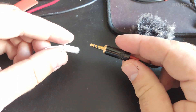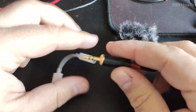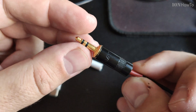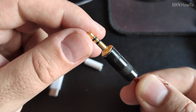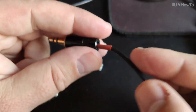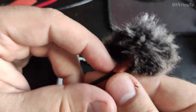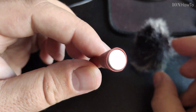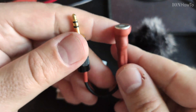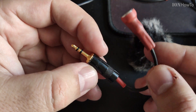It works pretty well for my phone, but it can also be used on a regular recorder. This one cannot go directly into the Apple adapter or any other adapter, because it's TRS. For mobiles you basically need four things on the jack, and this one has three — that's normally for stereo sound: ground, left and right channels.